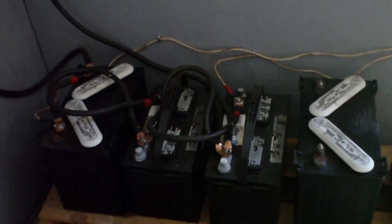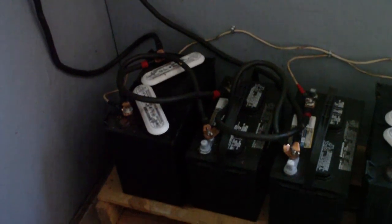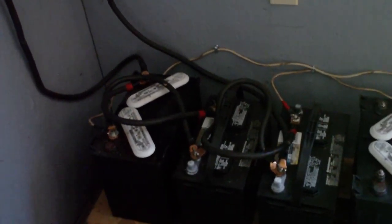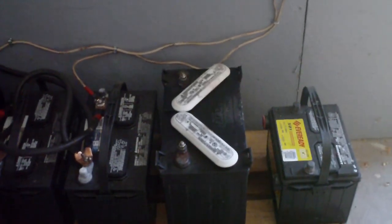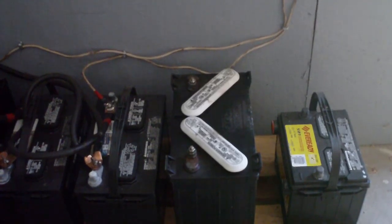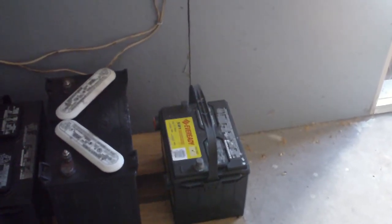That's how she's wired up. Here I've got my battery bank. Only the first three batteries are hooked up. The first battery is a deep cycle golf cart battery — it's a Club Car, which is a battery by Trojan, made specifically for a Club Car golf cart. The other two in the middle are marine deep cycle batteries that I've salvaged out of the recycling center and rejuvenated. This last one is also a Club Car golf cart battery, but it's under-volt — sitting at about 10 volts with a bad cell, so I'm trying to rejuvenate it. And that's just a starting battery I keep around in case somebody needs a boost.